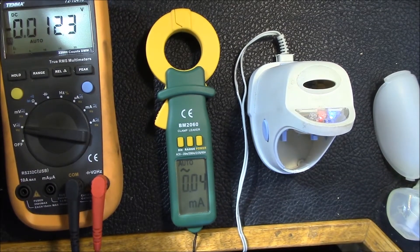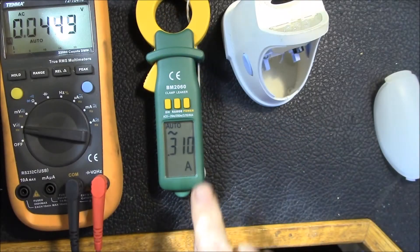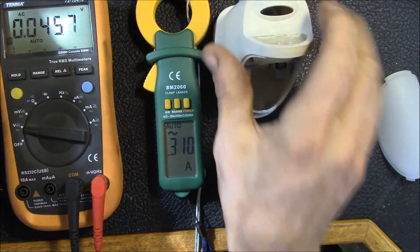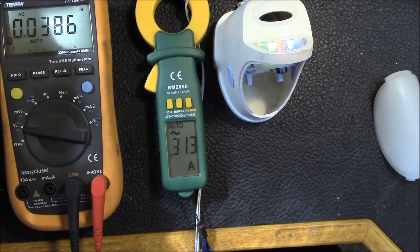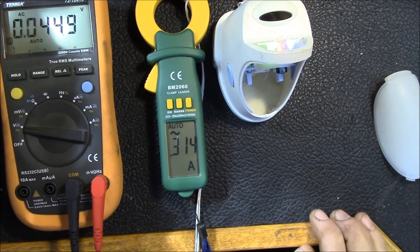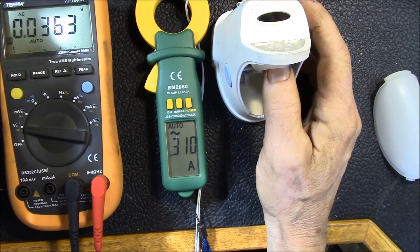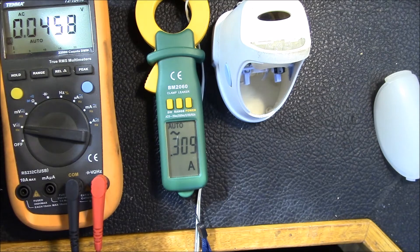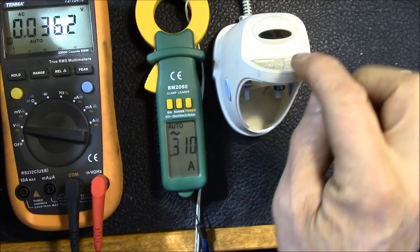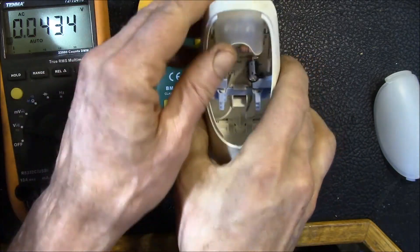Let's take a look at the voltage. I've got my voltmeter here — roughly 9.3 volts. There's 310 milliamps running with the lights off. Now with all the lights on full, 314 milliamps. So these LEDs only take about four milliamps of current. That's just short of three watts of power — 9 volts times 310 milliamps. The button only controls the LEDs; this resistor in here is on all the time.